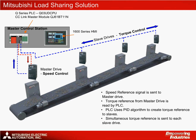To keep the system stable, a Q-series processor is used to perform a PID loop on the torque signal from the master. The slave drives are not trying to run at a specific speed. The actual motor shaft speed is going to vary depending on how much torque they produce, so they are acting in the same way as a slipping clutch would in a mechanical system. We call this torque mode with speed limit. The actual instructions are transmitted via CC-Link, which has the advantage of being fast, robust and also allowing simultaneous commands to all the slave drives using the group write feature.